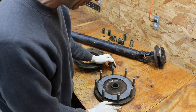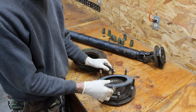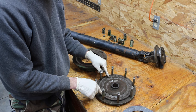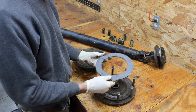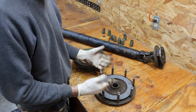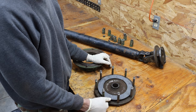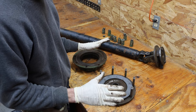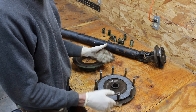Here's the mistake a lot of people make: they let their baler or implement get wet and leave it outside. What you end up having, as you can see here, is a lot of corrosion on the metal assembly. It literally rusts — all the components rust together. So when you hit something solid, it doesn't have any give, and you end up causing damage as if you didn't even have a slip clutch assembly. It totally defeats the purpose if it's over-tightened or rusted together.